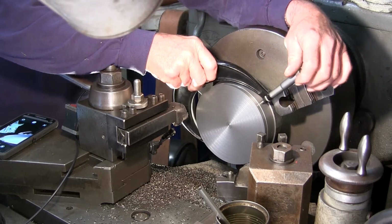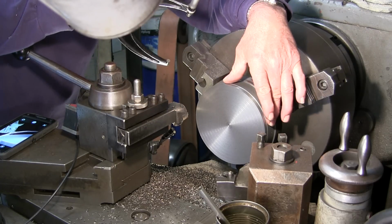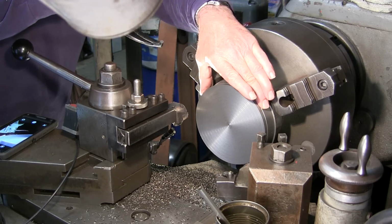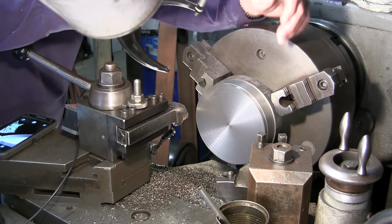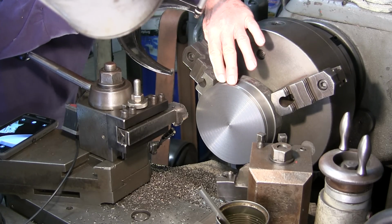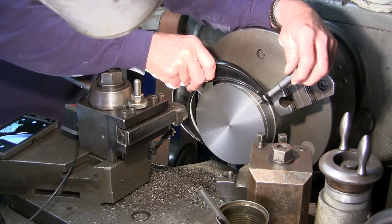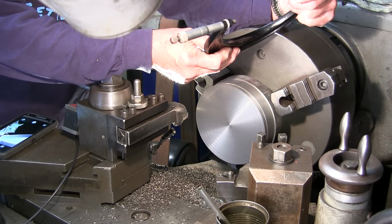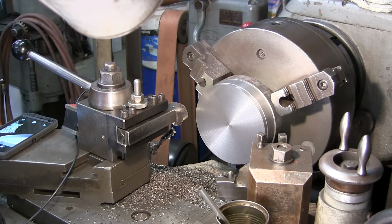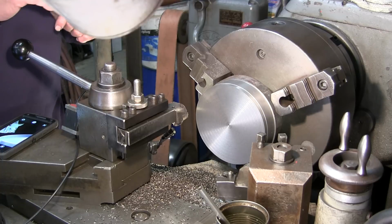Okay, I grabbed my micrometer out of the cabinet there, and we mic'd the flange on our other part because that's what we want to skim this to, slightly oversized on the OD of our flange part, and then we're going to start doing a bore. So we just want to have this outside surface and a bore all roughed out, and our dimension is 5 7/8, and right now we're right at 6 inches 1/1000. Alright, so we can take another skim there.